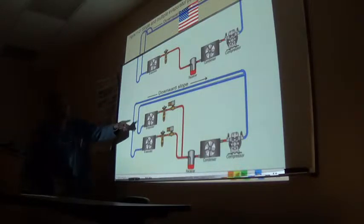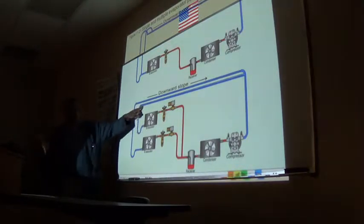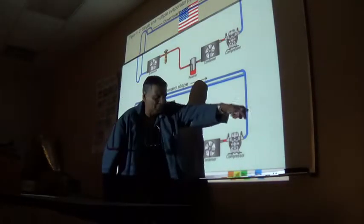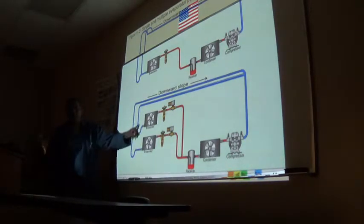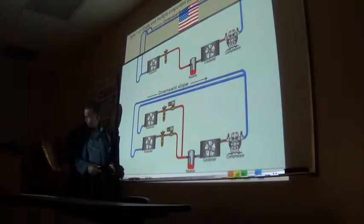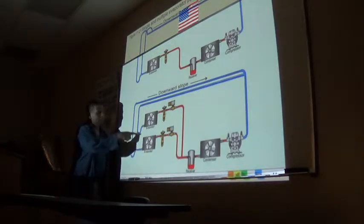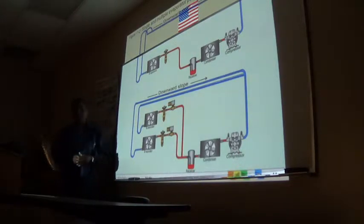The reason they put this is to ensure like 100% oil return, because once the oil hits here, it is going to return here. But if I have one common suction coming up straight here, say this may be 7/8 inch and this may be 7/8, I'd have to up this to 1 inch.